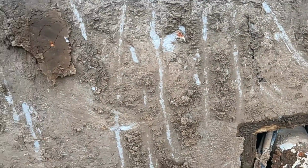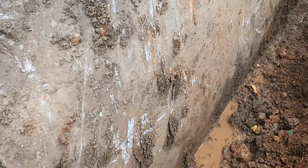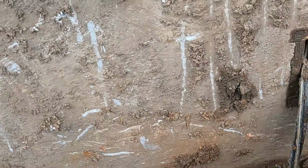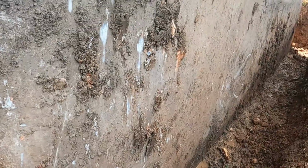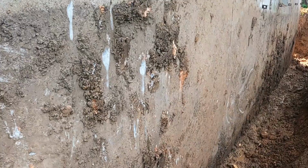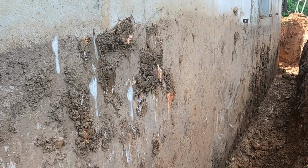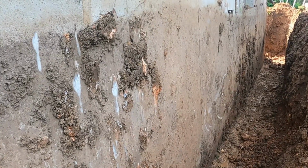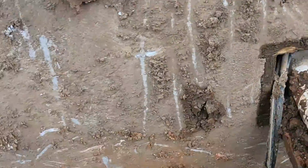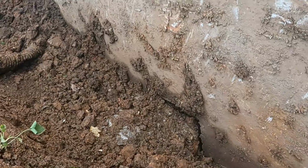So what I've got is some seepage line that is in the sock already. It's in the fiber and has little pellets in there, that's instead of washed rock. I think it's generally used on just drying up areas in the yard and things like that, but I did use it on another basement a few years ago and it worked well, solved the problem there. And due to budget reasons, mainly on this one, that's what I'm going to do again.